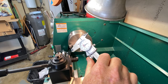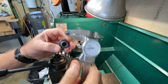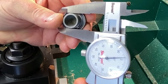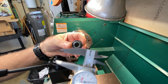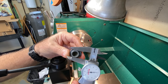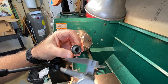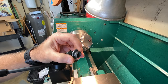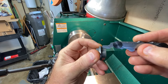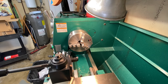We're going to turn it down for the major size of the thread diameter, which is an M18. This is a Grizzly 3202-8, full eight inches long. If I measure this thing up with the calipers I get 0.698 — just around 700 thou — which I believe is an M18 size, about 17.7-something millimeters. The Google confirmed that. The thread pitch is measured at 1.0 — I used a thread pitch gauge for that. So that's what we're going to do.